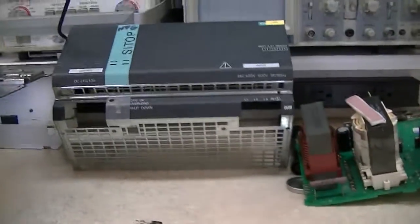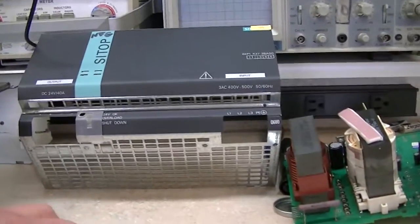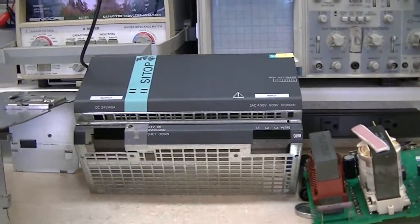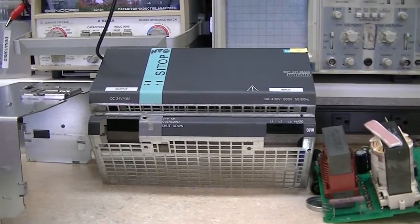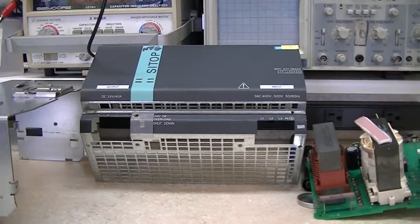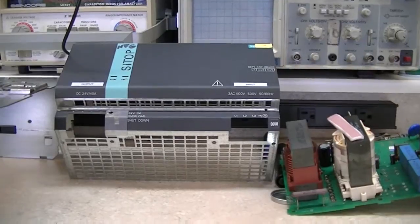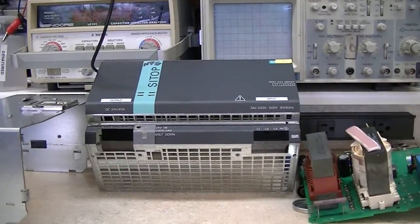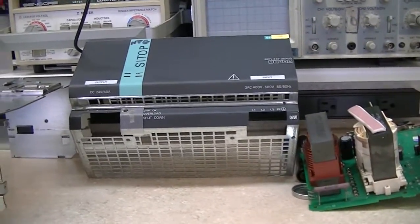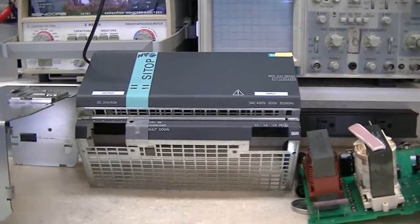This failed — if you watch that video you'll see there was some major damage from several major wrecks on that machine. We finally slowed down enough that within the past couple of weeks, me and one of the Zerman service guys disassembled the Z-axis, removed the C-axis from the Z, repaired it, and got it back together. But once we did get everything back together and tried to start the machine up, this Siemens power supply went bad. I think hindsight's 20/20, but I think this had been going bad for quite a while, long before we touched the machine — we checked all the wiring and cable and made sure we didn't get anything pinched.